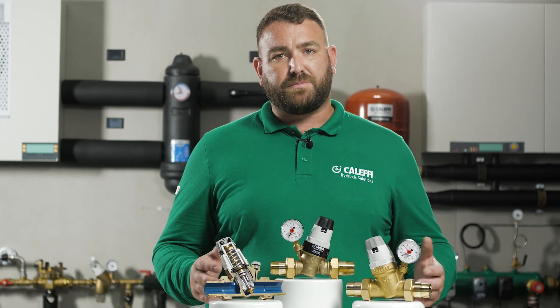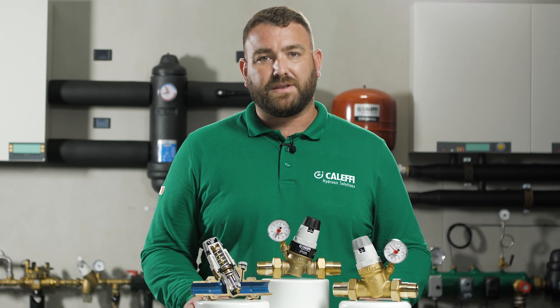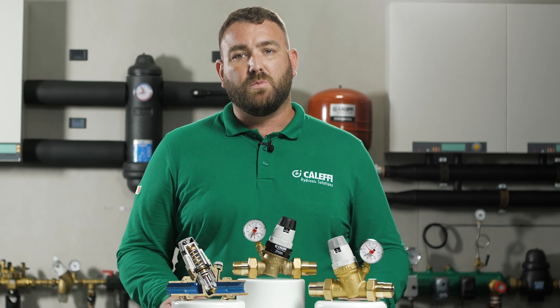There are two types of pressure control: static and dynamic. Static pressure is the head or pressure of water in a system when the water is at rest. Static pressure control is therefore the maintenance of a set pressure within the system when there is no demand or flow. This is particularly useful for single point use outlets, especially where protection is required due to low pressure rating, for example washing machines and showers.